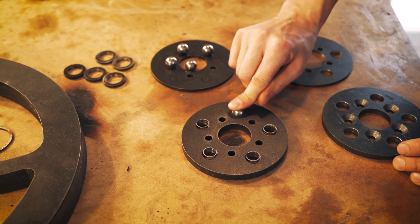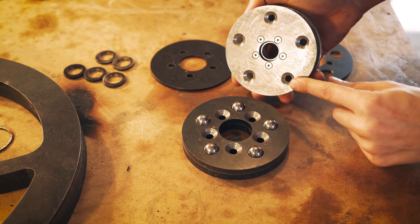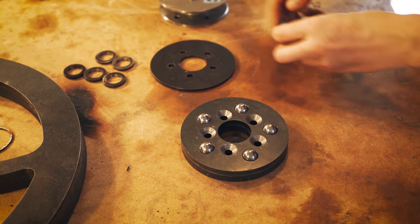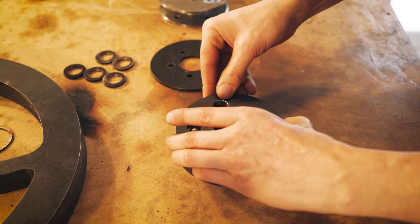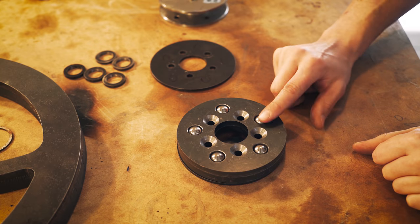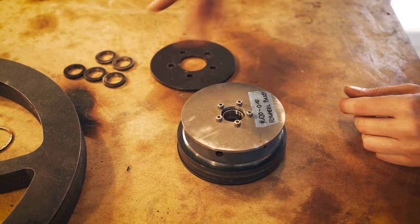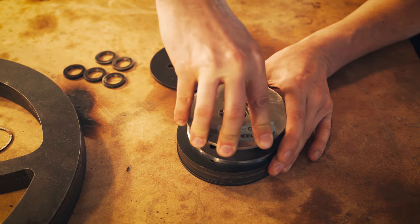The design that we have in CAD, I feel the springs are very tight at the loosest setting. So I made this plate. It's a spacer plate. We put the spacer plate under. Now you can see that the marbles end up much lower. They snap into the marbles, but it releases with enough pressure.